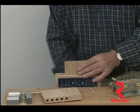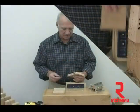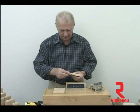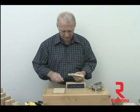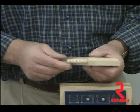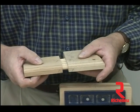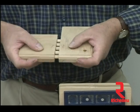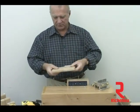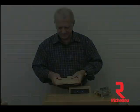Remove the Dowelmax. Once the drilling process is complete, we then insert the hardwood dowels, which of course should be glued, and you can insert any number or any sequence you like, provided you perform the same process on the second piece of wood. We are using 5 here on the one before, and that gives you a very strong joint with this edge flush and this reference face flush.